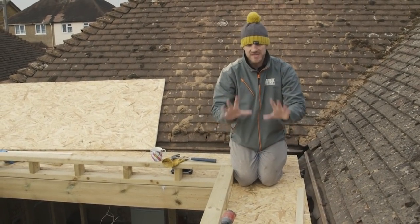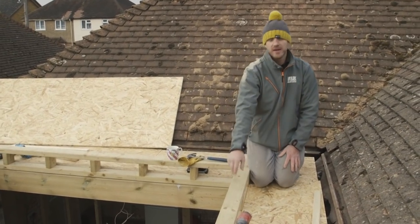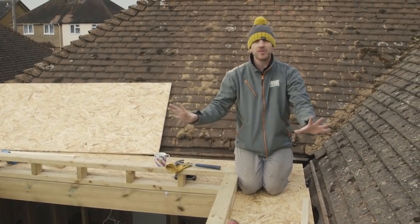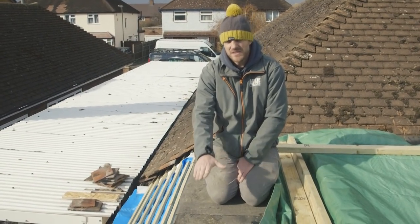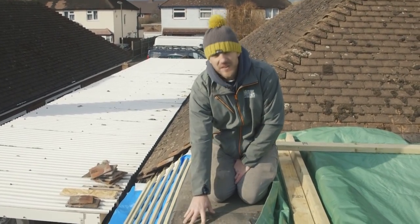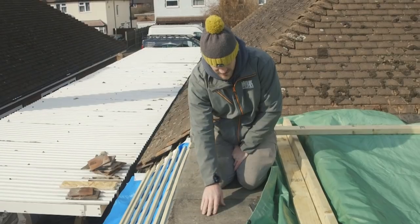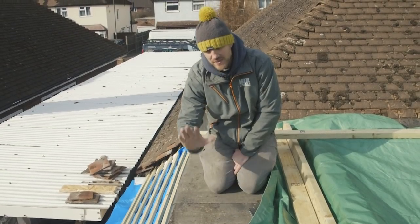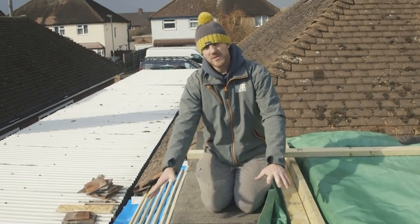The whole thing is watertight. Once that's done with all the different layers of felt, the roof lantern literally just sits on top and then we've got a bead of silicone and the whole thing's watertight. When we were here last time, we had the furrings on the rafters, then the OSB. This is the first layer — your 3B tack-down sheet. On top of this you've got your 2mm underlay, and then your final layer is your mineral capping sheet, which creates the perfect seal all over the roof.